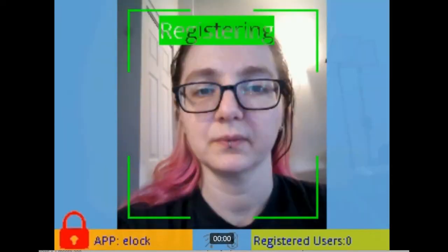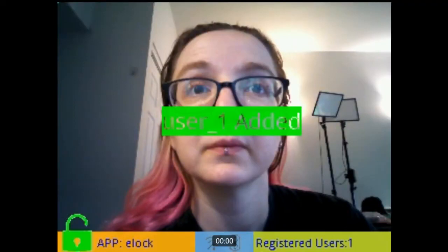When you press a button, it will register your face. It says 'registering' and you have to shift your face around a little bit so it gets all the angles of your face. Then it says you have been added — it knows who you are. You can save that to memory for long-term use. The number of faces you can save is a couple hundred to a thousand, depending on how precise you want it to be — it's probably a memory, storage, or search speed thing. The faster you want it to go, the fewer faces it has to look through. So if you only have a hundred faces, you can use a slightly stricter model than if you're recognizing a thousand.